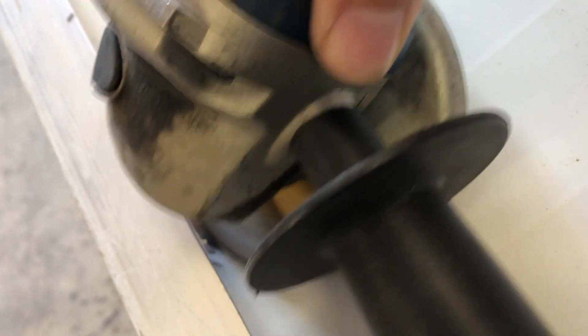This is a big no-no with solar panels, as water penetration is a huge killer of solar panels. We'll seal it back up later as best we can. I took the bus bar down beyond its tinned coating so I knew it was exposed beyond the back sheet.